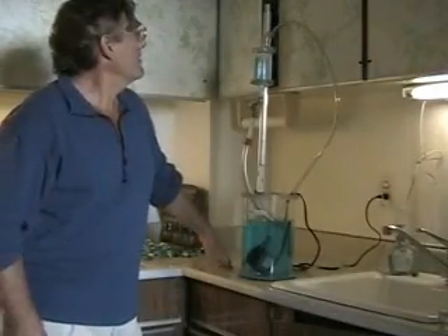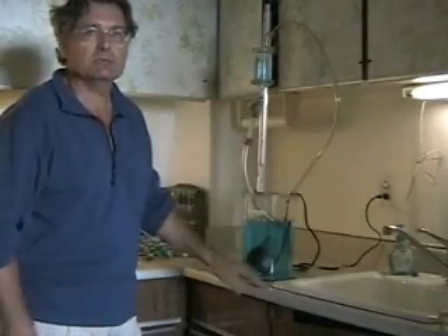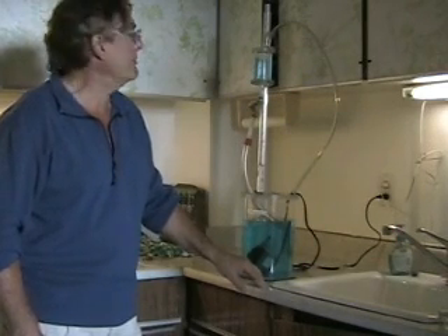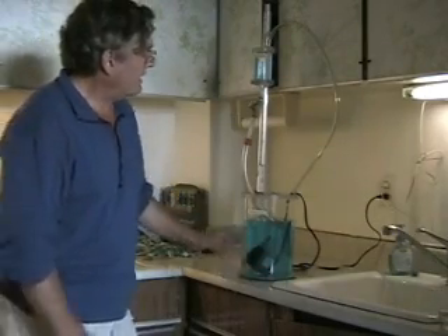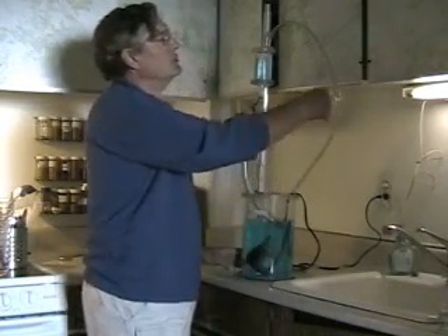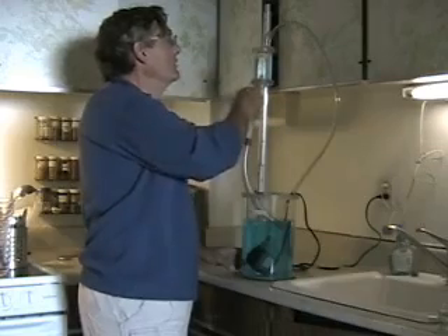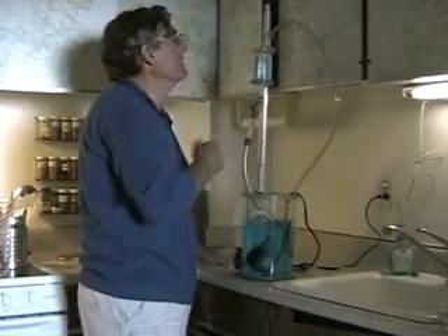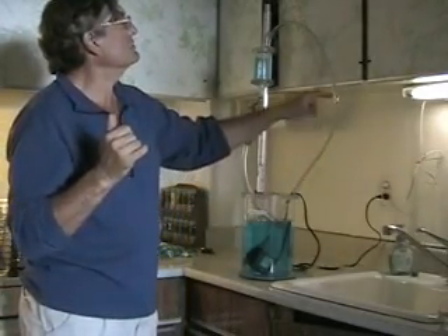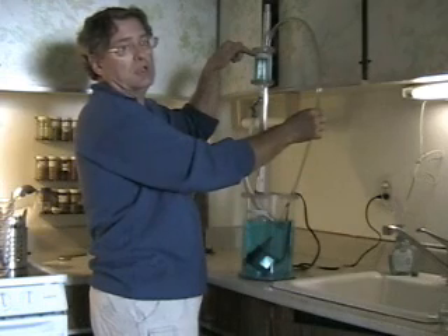This experiment will show how pressure varies in the discharge line of a typical pump system, perhaps a bit more of an industrial type. What I have is a small reservoir containing water, a centrifugal pump, a discharge line pumping fluid up into an upper reservoir, and the reservoir is being drained back into the tank so I can recirculate the water. What I want to show you is how the pressure varies in this discharge line, especially in this region above the level of the upper tank.